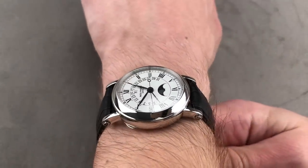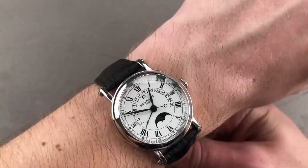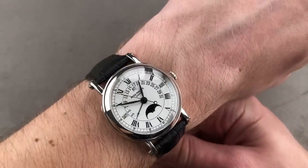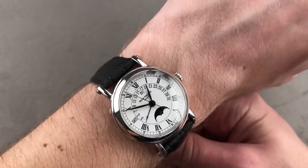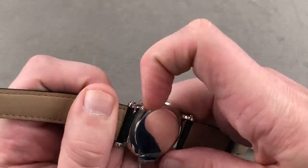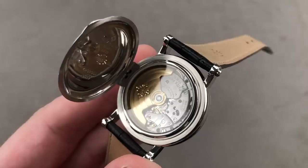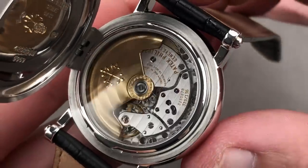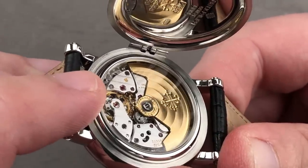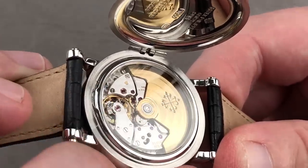They're prominent and broad, but you can still wear this watch on a 13-centimeter circumference wrist. The dial is no-nonsense, high contrast — perpetual calendar, retrograde, and moon phase — and of course the look from any angle is elegant. It's a sporty watch to be sure, but it's also a dress watch first and foremost, which means it wears well with almost any office attire. All 5059-range models were built between 1998 and 2007 prior to the use of the Patek Philippe Seal in 2009. So you have mirrored bevels, rich Côte de Genève, engine turning not just on the base plate, but also on the click reduction wheel adjacent to the rotor, and engine turning at the center of the rotor as well.